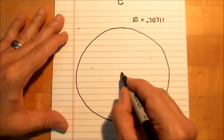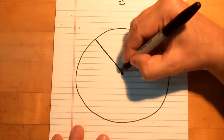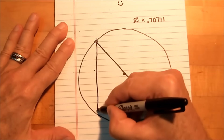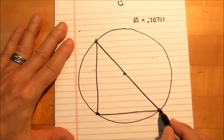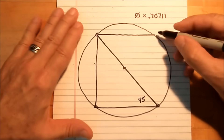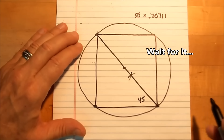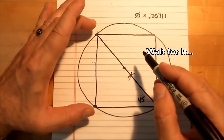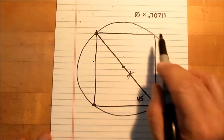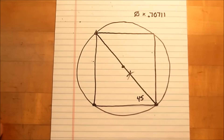How do you know this? Well, let's just find the center of that circle first — theoretically, the center of the circle. Strike a line 45 degrees through the center of that circle, and there is a reason for this: a 45-degree triangle. If you do the exact same thing on the top, you have a square. In order to find this leg right here, it is the diameter times 0.70711, which is a function of 45 degrees. The diameter times 0.70711, function of 45, will give you either of the two legs. In a square, assuming all four legs are the same, that would define your square.